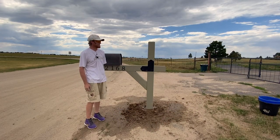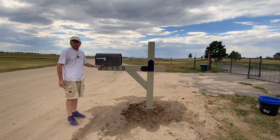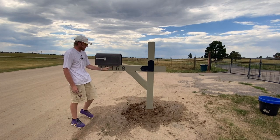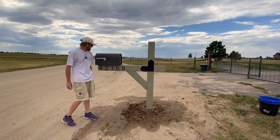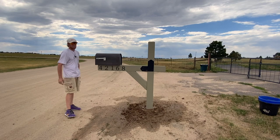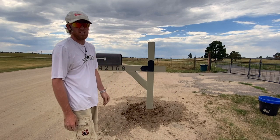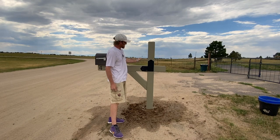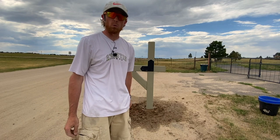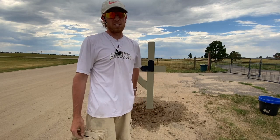Alright guys, that's it — she's in. All that's sopping wet and it's going to soak in and the concrete will harden down there. We got her set right at 44 to 45 inches — just an inch or so higher than I really wanted, but setting it level and getting it where I want it worked its way up just a hair. We're happy — it's in, it's nice and level. You'll be able to drive up and access it nice and easy. Thanks for watching! Hope you had fun with this quick how-to of a mailbox from start to finish. You might put an LED light up here, hang a flower pot — it's sturdy enough to handle whatever you want. If you enjoyed, please smash that like button, subscribe to the channel, and I look forward to seeing you next time!